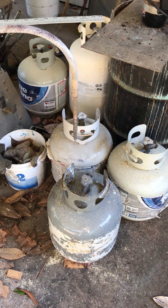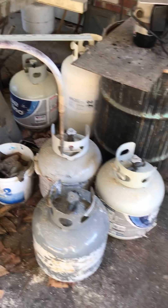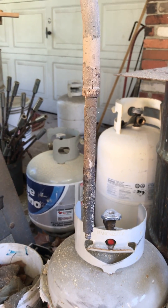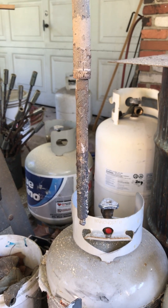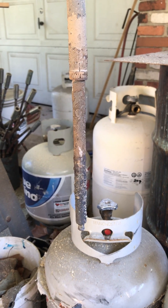There's been some questions on how to take temperatures of molten metal, so I'm going to give you guys the lowdown on my setup. Starting out, this is an 8-inch MIFCO replacement type K thermocouple. It's good up to 2300 degrees Fahrenheit, so you can do brass, bronze, and aluminum.